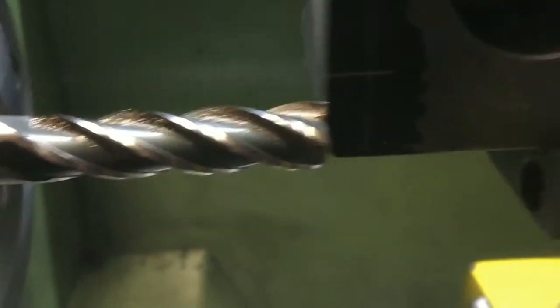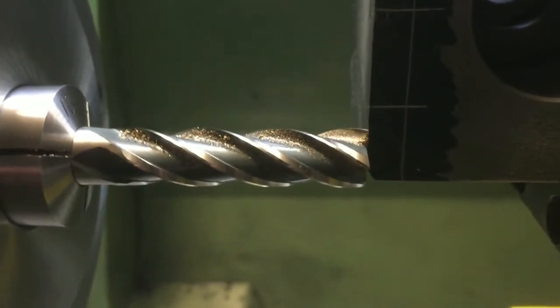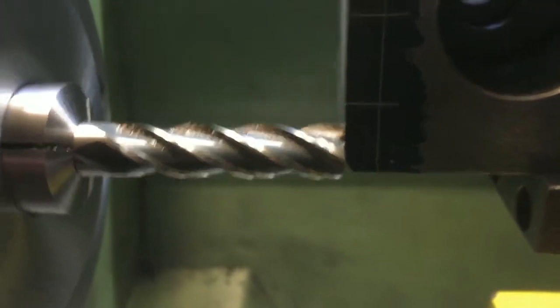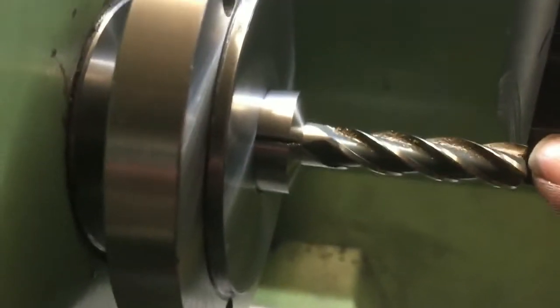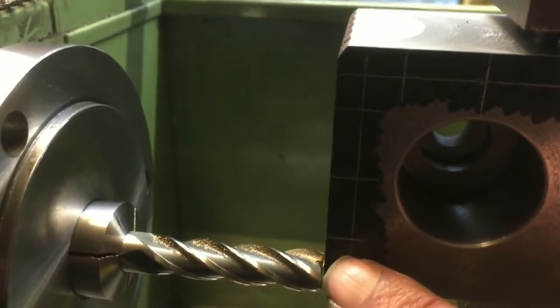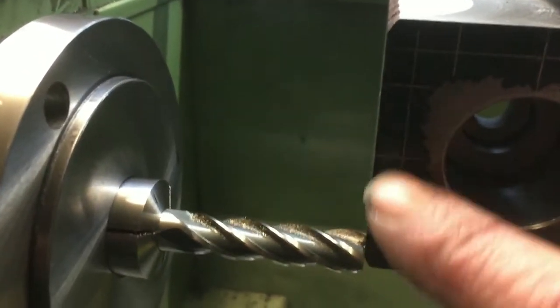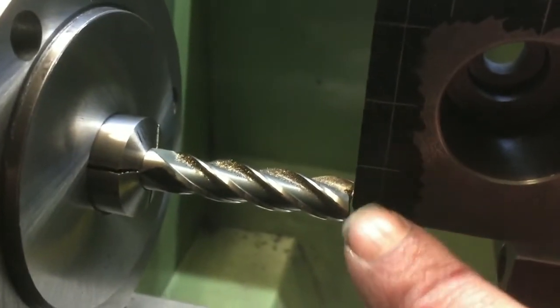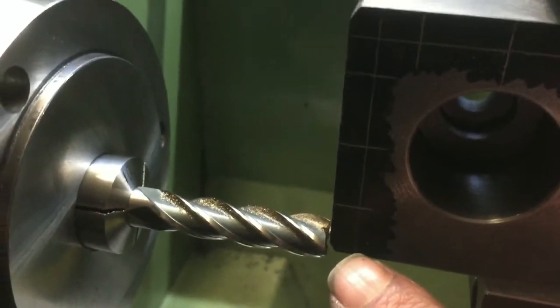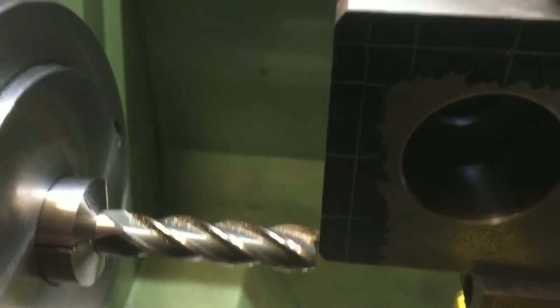What I'm aiming to do — as you can see I've drawn a line on the block. That line is at 6mm from the face; I'm planning on machining it to 5.9mm and leaving the last 0.1mm for the dovetail cutter to finish at the end. The next line up is 16mm down from the centre line, and there's another one above that, giving me 32mm on the flat square shoulders about the centre of the block. It'll be a square 32mm by 5.9mm deep. Once I've completed that I'll change out for the dovetail cutter to cut the dovetails — but for now, let's get machining.